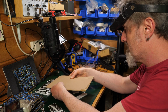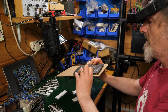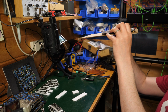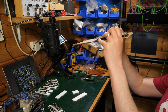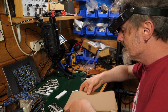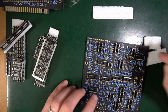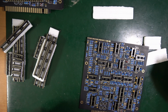And the key is going to be just turning it over. They're all falling out because there's an error, and that error is that some of those capacitors are a little bit high. Alright, rethink. See, I've got these yellow ones here that I put in, obviously rashly, which are just too tall. They're too bleeding tall.